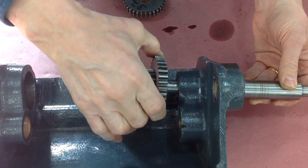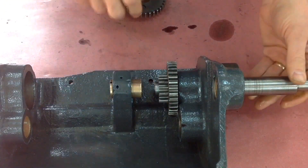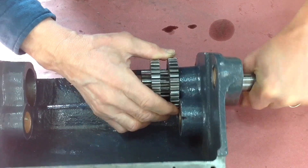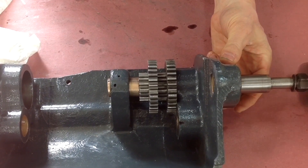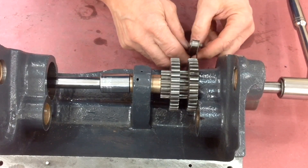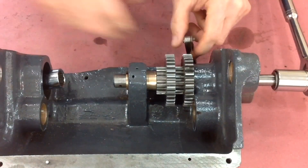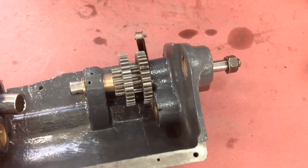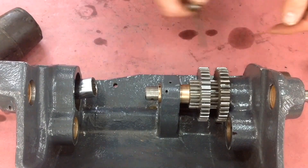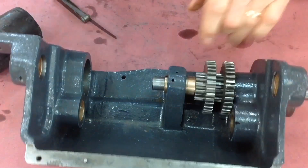Oil up the bushings and the shaft as well, then slide the shaft in. The first compound gear slides on to the keyway and is locked to the shaft, then comes the second gear which spins on the shaft independently. Once you get the shaft in, there's supposed to be only four thousandths clearance, which I'm measuring here. What I did is put in six thousandths clearance and then tap that bushing — I had to bang it on the other side a little bit to loosen it up, but once I did that I had a nice clean four to five thousandths clearance.